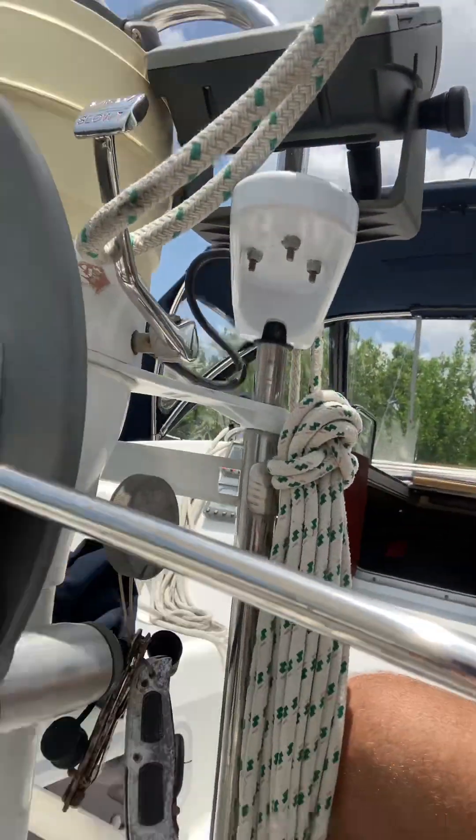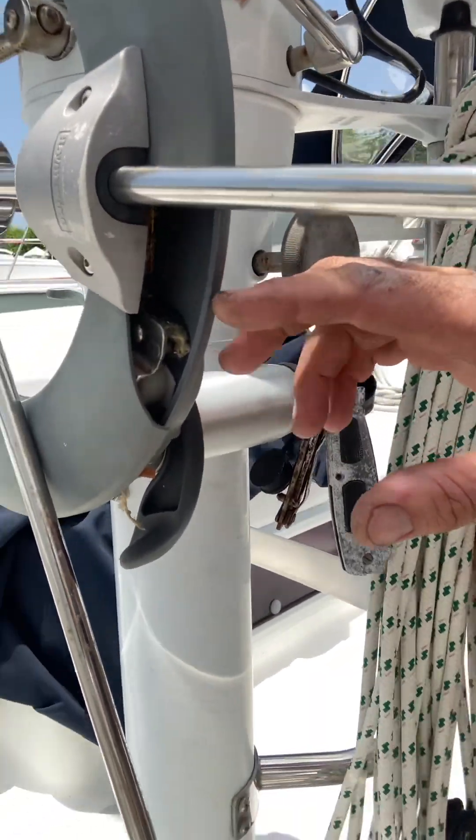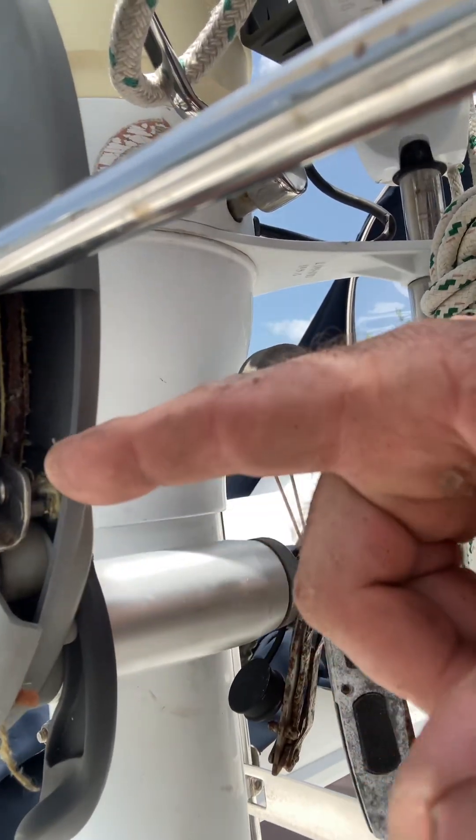While I'm out here I'm going to show your autopilot — I've got Jeff inside rewiring something. I was troubleshooting your autopilot. This piece of plastic off of your wheel pilot broke off — this thing's just old. And I don't know if you can see in there, but the belt is gone.